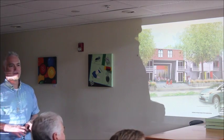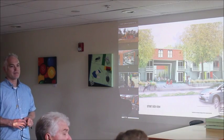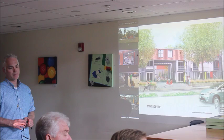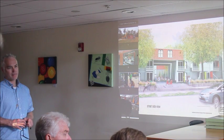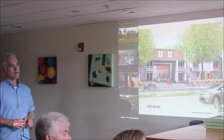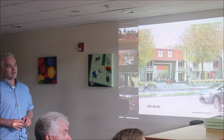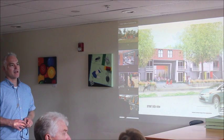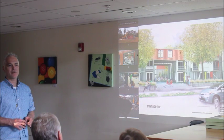It's zinc paint. Yeah, you definitely want to ventilate if you're welding. We found that out. But it's a very, very good paint, obviously. The VOCs would be long gone. That would be a concern. So really, it's not a bad thing for the durability because of the quality of the paint. Right. The ones that we get are rusty, so we do treat them with phosphoric acid.